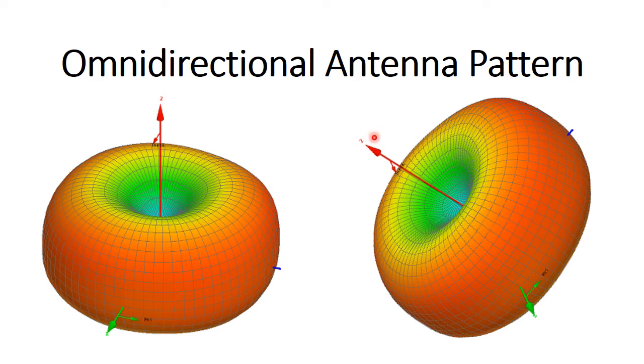Now why is that important? Over on the right, I'm going to show you a picture of my helicycle in forward cruise flight. The antenna orientation is as you see there. When you're transmitting, you're typically trying to talk to somebody on the horizon — not up in space and not down below you. You can see that transmissions in the forward axis are inside that area of very low radiation. So this antenna, mounted on the bottom of the frame in forward flight with the nose tipped down, is transmitting very little energy in the horizontal direction. That mounting angle for these antennas is sub-optimal, to say the least.